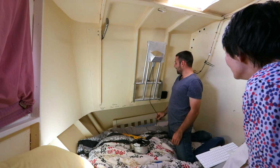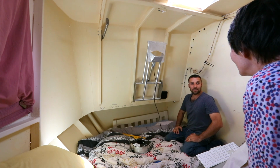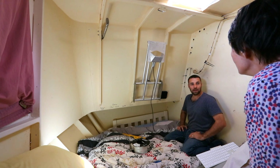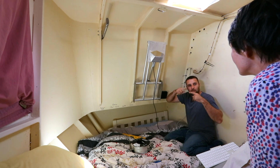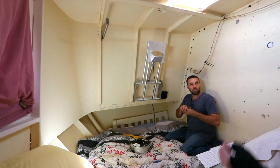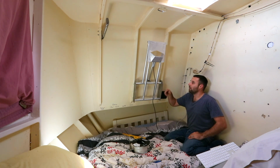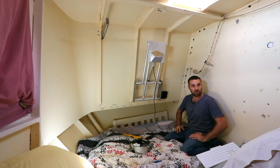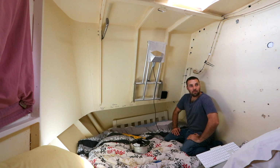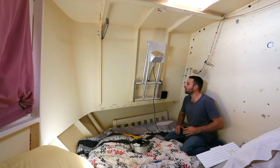Oh, that's awesome. Cool, eh? So you don't actually need any safeties or any of that sort of stuff, because it can't physically pull the ram apart. And the way that this works, a little electric motor spins some gears which spin a thread, if that makes sense. A bolt spins and the thread goes in and out. So if the power fails, it doesn't crash or anything, it just stays where it is. So it's a really safe way of doing it as well. And it's only powered when you're moving it, so there's no residual power just hanging around or anything like that. Yeah. Cool.